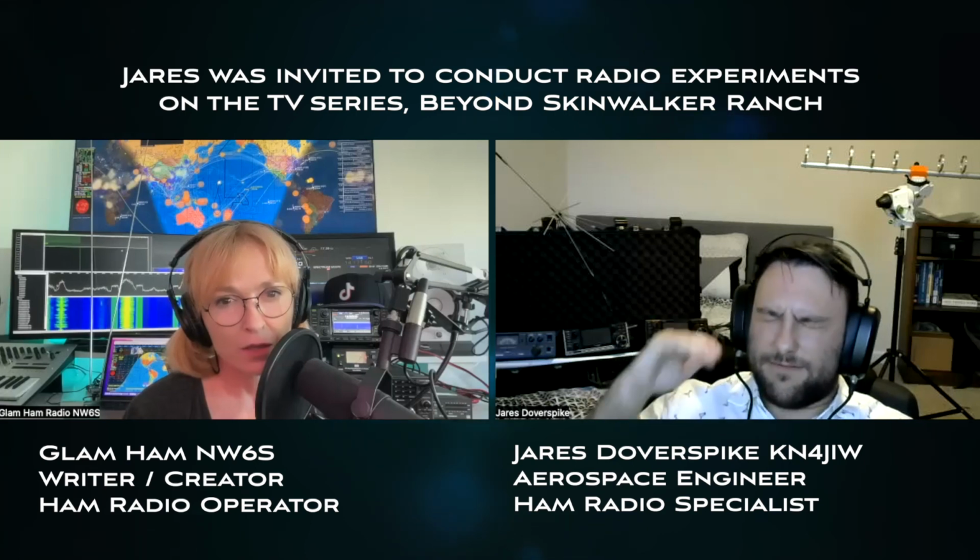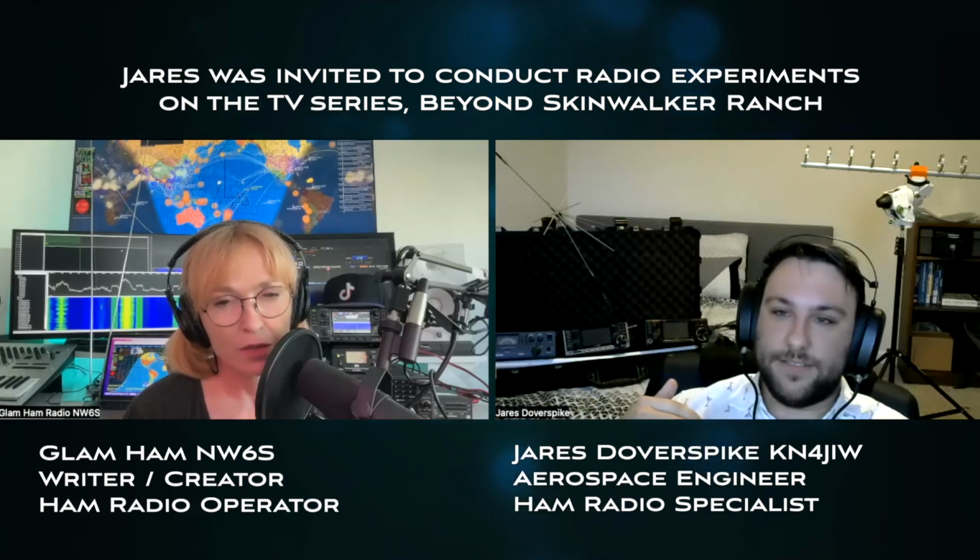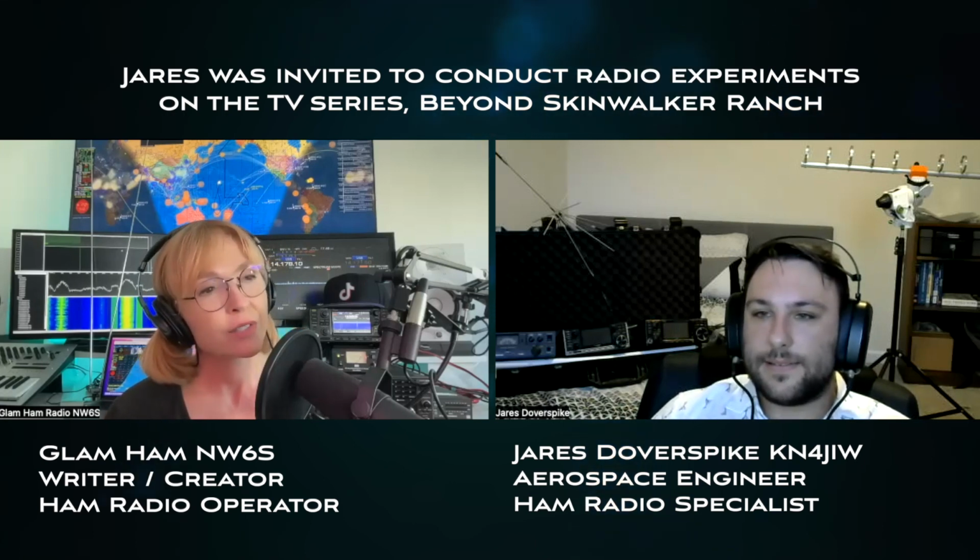So I was transmitting at 80% power at about 50% microphone sensitivity. So I would have been transmitting at about 80 watts, since the 145 megahertz power is 100 watts. Okay. And so in the show, of course, we see for all of like 60 seconds you're doing it.